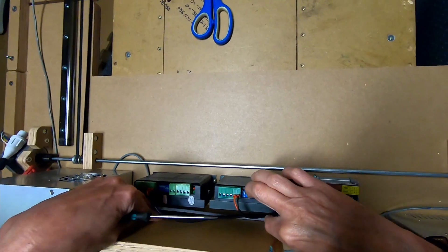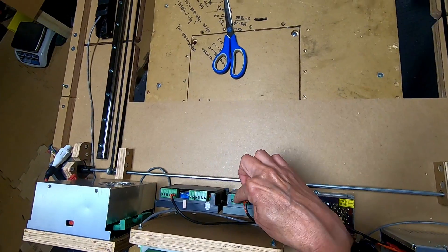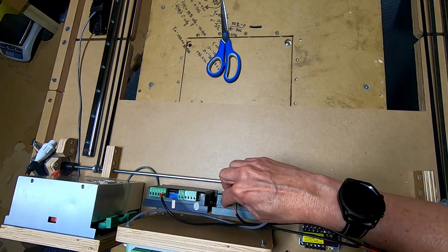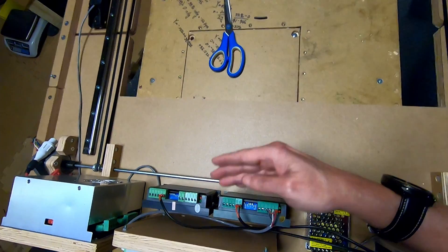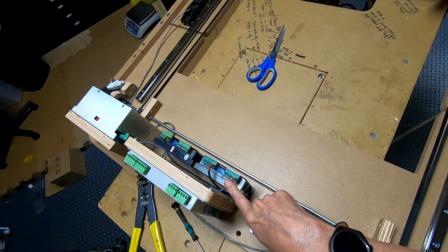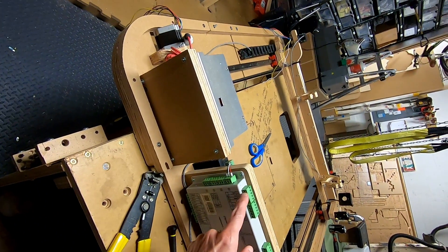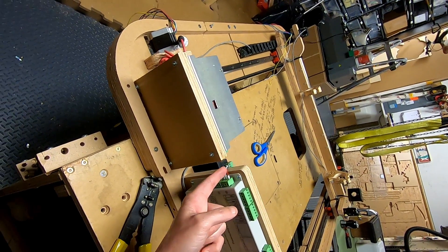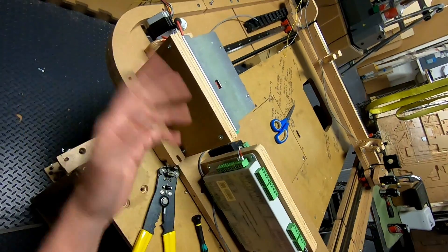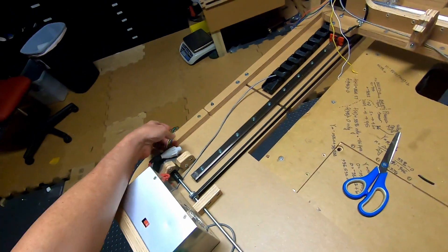Let's tuck this wire in down here. We want to make sure that the signal wire does not come close to the motor wires that will be connected to the motors. Since this is not shielded, I'm going to try to shield the motor wires instead. The reason I didn't shield the signal wires for the driver is because there's no suitable ground — the ground terminal here is already being used for the power supply. Shielding the actual motor cable should be sufficient.